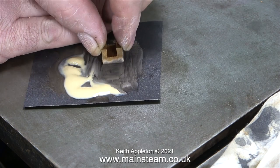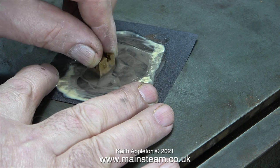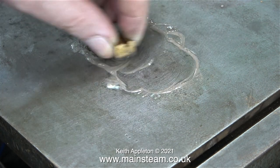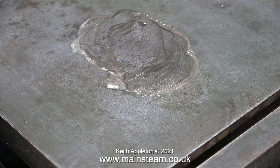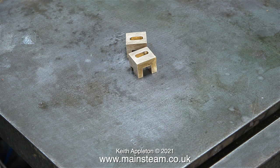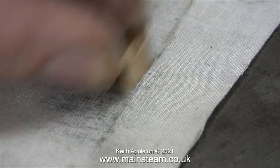Sparing no expense, I've selected a new piece of wet-or-dry sandpaper, and this time I'm using T-Cut instead of oil because it helps the abrasion process and allows the part to move more freely. Often when I show this kind of process a debate starts — people tell me you should always go in a figure-of-eight motion, but in this case I'm working in the opposite direction to the way the valve is scored. After a lot of time and effort that makes my arm ache, they both look great. A rub on the cloth completes the operation — two perfect slide valves.